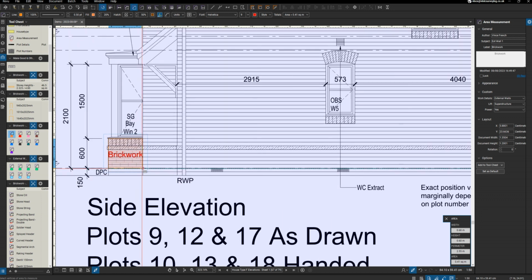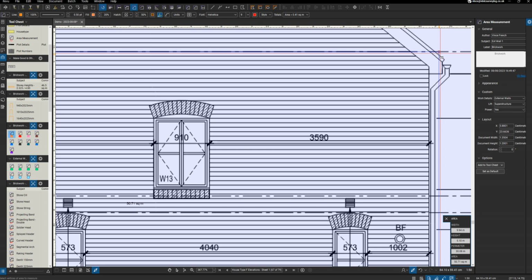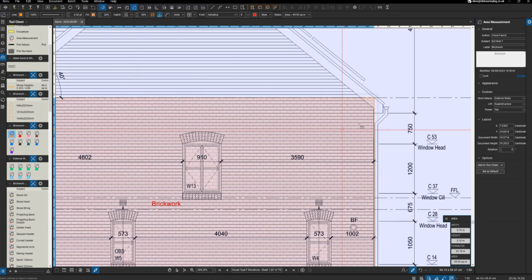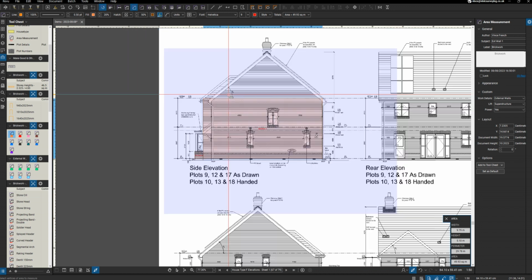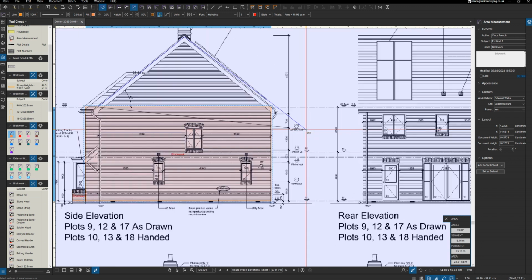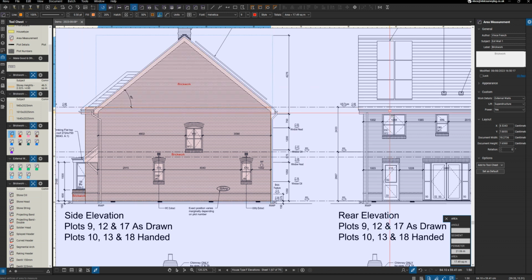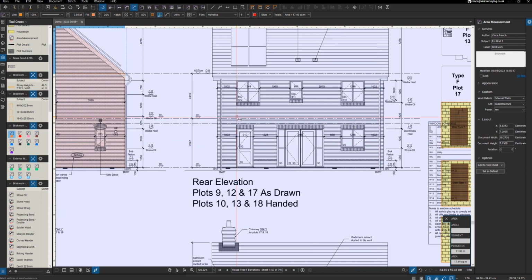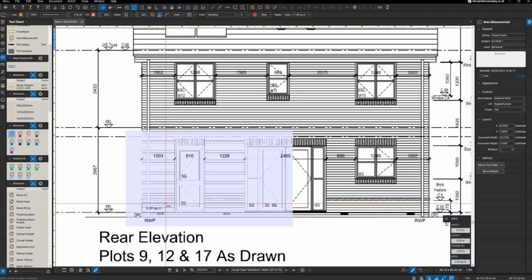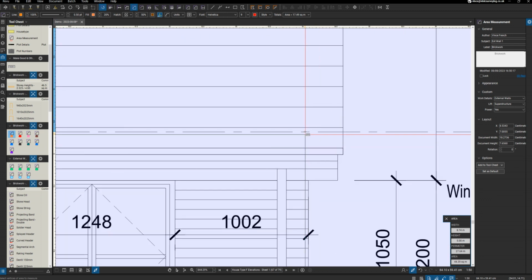Right, external walls. Now, up here, I'm going to measure up to the underside of the truss, and I know that's a bit more extra at the front of the building because the facework doesn't go up that far, but then the facework doesn't go up behind here. But what that then allows us to do is it covers things like where on the internal skin, where it's all measured as full-size blockwork, it will cover things like coursing blocks, etc. So that's the way I've just viewed it for this. If you want to get into finite details, you can measure everything separately, but let's just carry on through this.